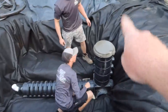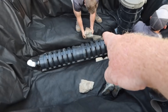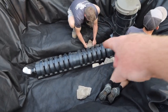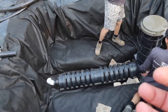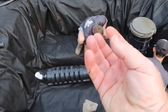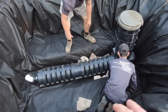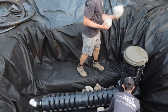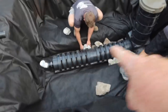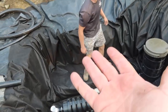So we got the centipede and the snorkel in. Obviously the fabric and liner are in there as well. You can see this big channel on either side where Corey's placing rocks. We need to fill that whole thing — we can't fill it with gravel because water wouldn't flow through well. We want to create a bunch of interstitial spaces so that water, as it comes up, seeps out through the aqua blocks. Every time they put a rock in, they're not making them fit tight — they're creating bridge-type areas so that water passes through evenly.